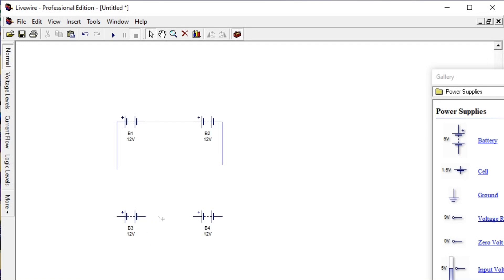You connect this negative to positive here. So you can see now that we have one positive output here and another positive output and negative output. This is the negative output and this is the positive. So what you are going to do is connect them — these are in series, these are in series — so the outputs of the two series strings are now connected in parallel. Positive to positive, and this negative to this negative. Automatically you now have one combined output.